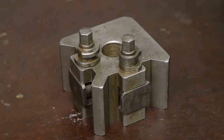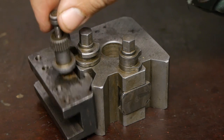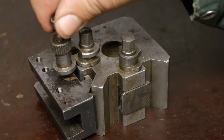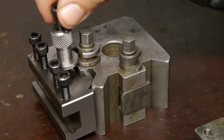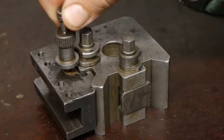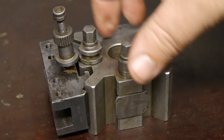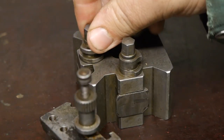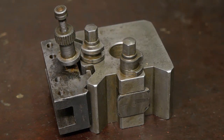On the other hand, the height adjustment thumb screw on the original holders is a bit too small, so it very easily drops below the height stop. It's not a problem with a fake holder. Only a few degrees on this cam actually work. I think over the years there has been some wear in this mechanism, but this will surely benefit from a larger diameter thumb screw.